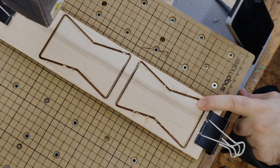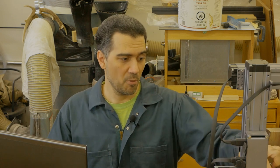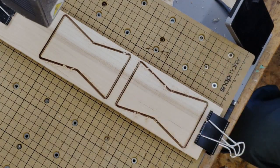So one of your strokes might go deeper, one of your strokes might go slightly shallower, so you're going to have a wavy edge, and that may prevent the proper gluing of the butterfly to the wood. Another method similar to that one is to do the outline, but then use a router at a set depth. And that's the method I'm going to be using right now, because the router, being a powerful machine, I can do a much bigger bit, can help me clean out a lot of that area pretty quickly.